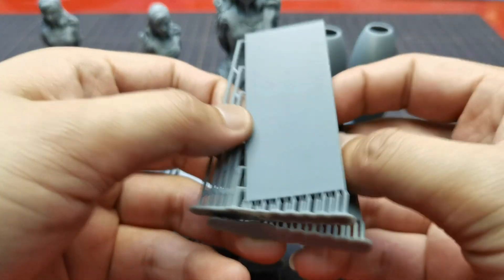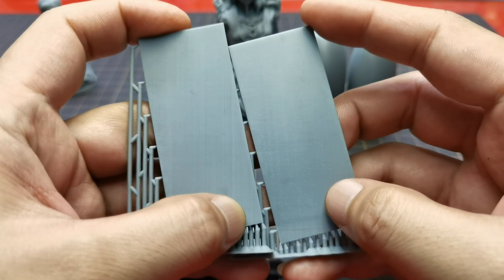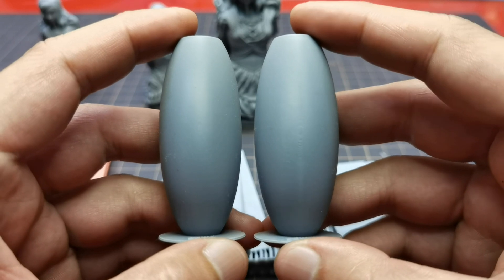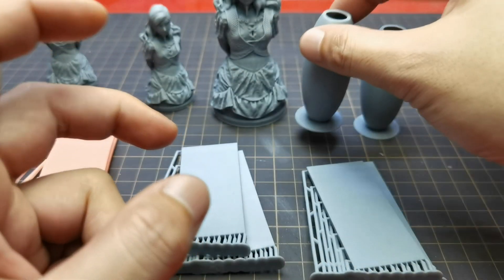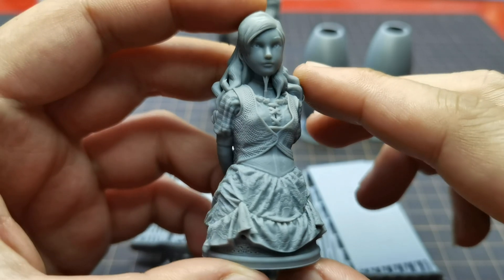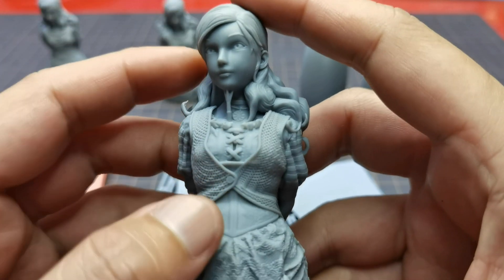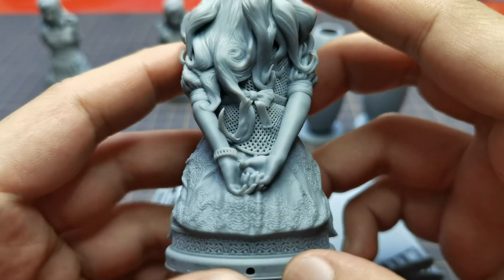After I lubed the lead screw, the Y and X axes are looking good. I then did a test — on the left, a print with anti-aliasing image blur 2, and on the right, without anti-aliasing. I could see no wobble lines. For the very last print I printed a model from Anycubic, everything is looking very good. I then scaled it 1.5 times bigger so we could see if there are any wobble lines or bad lines from any flexing in the Z-tower.